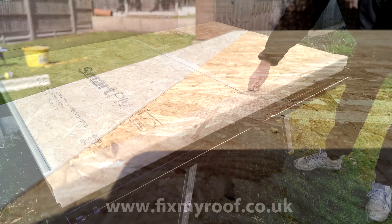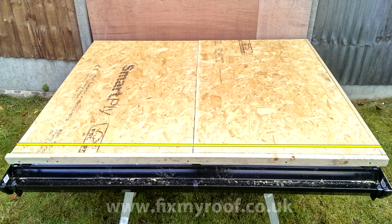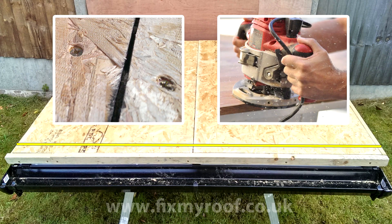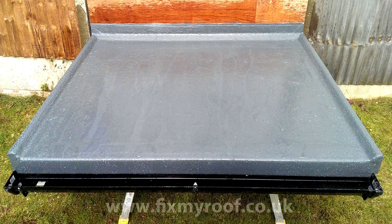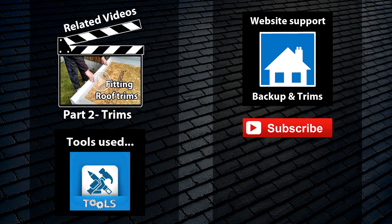If this is the case and you want to address the problem, this is how you do it. Simply hold the length of trim on the roof in position, then draw a line across the rear of the trim. Make sure any screws or nails are screwed or punched below the depth of three millimeters, and then route out to a three millimeter depth. Now you will have a nice flush fitting drip trim. Having said all that, I hardly ever bother as the fall is normally sufficient and the ponding is usually minimal. Also, a fiberglass roof is totally waterproof and jointless so it certainly won't affect the performance in any way. But if you need to, it is an option and it's relatively easy to do. If you need information on available trims and trim sizes as well as applications, these are all available on my website in the links provided and in the description bar. Well, that concludes this video on roof deck preparation and in the next video we'll be cutting and fixing the roof trims. See you there.